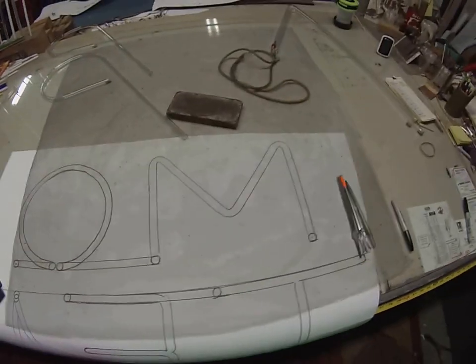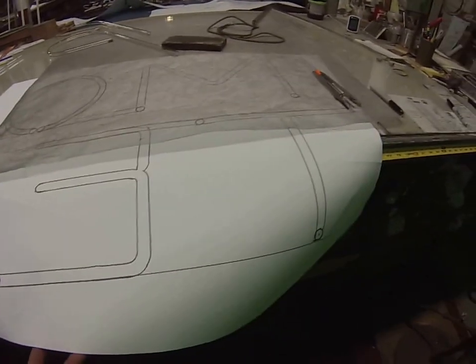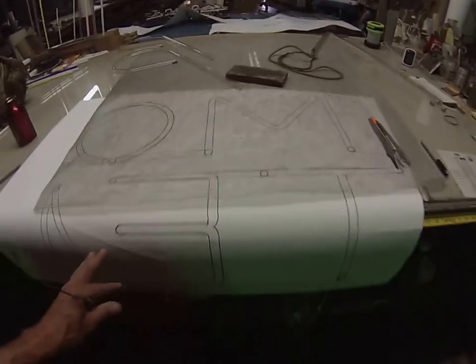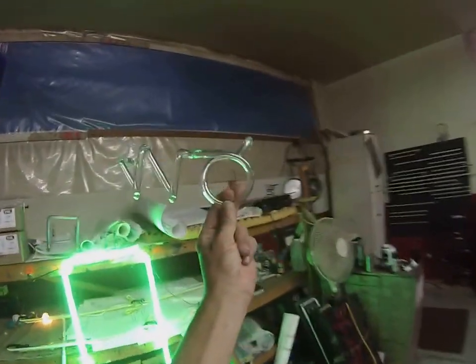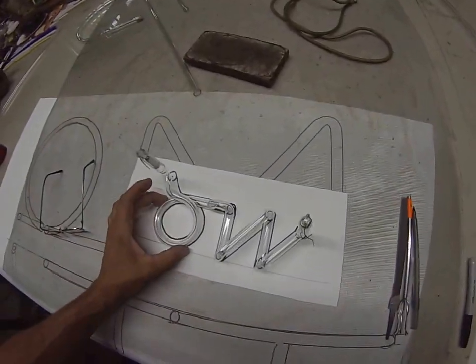So what I did is I took and I made new patterns. Like if you've watched any of my past neon videos, everything is bent in reverse — everything is bent backwards so that the neon is flat in the front when it's installed on the sign. These O's were really out of shape; I had to straighten them up again. The M's, everything — just from being repaired and remade, some letters were too short. You can see there I had to extend them so they're all the right height. Here's the little neon word 'no' for 'no vacancy,' and here's the pattern for it. That's what the pattern looks like, and here's after I bent the glass.